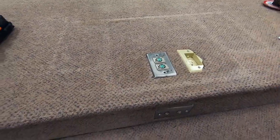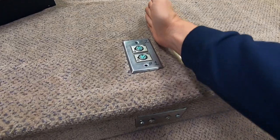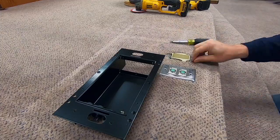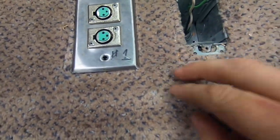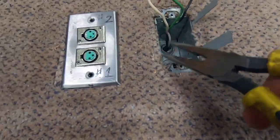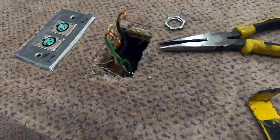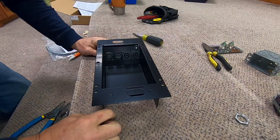You can see the outline of the pulpit. We're going to take those three devices and put them in this floor box. It would not surprise me if right here we find a floor joist, and if that's the case we'll notch it out so that basket can sit right above that floor joist. We're going to get the power turned off and get after it. This is a cut-in box, so we may not see a floor joist right there. These tabs are what help hold the J-Box in — and there it is, there's a floor joist.